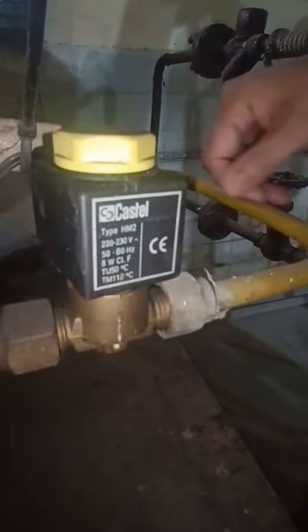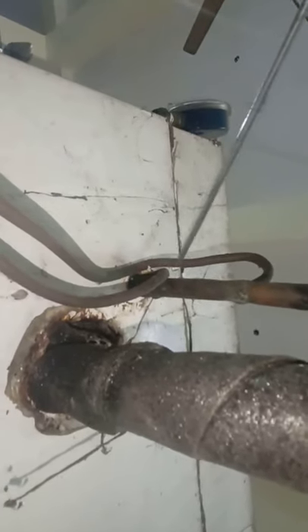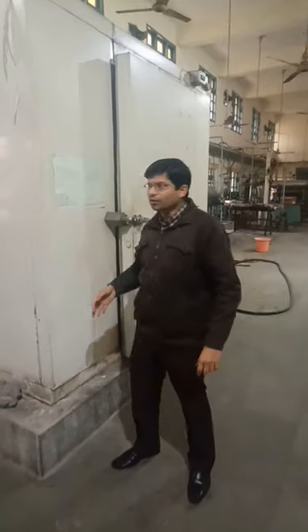After this, the liquid refrigerant line is going via this path to the evaporator unit. This is the inlet to the evaporator and this is the outlet from the evaporator unit. There are T-junctions coming out of these pipelines going to two pressure gauges, which indicate the pressure at the suction and discharge of the evaporator. Coming to the evaporator side of this system, in that diffuser unit we are having evaporator coils at the back.